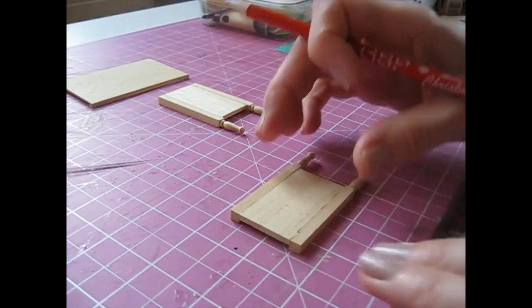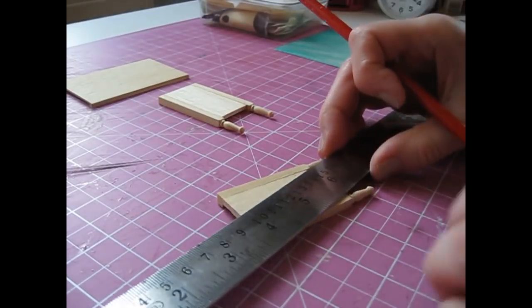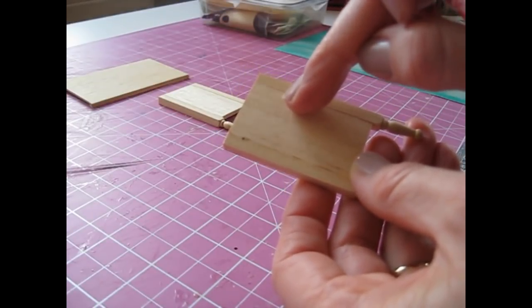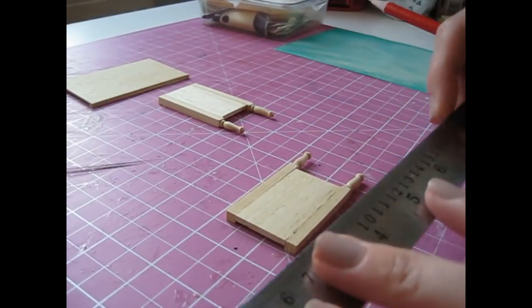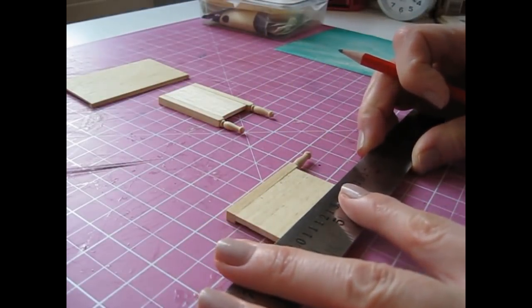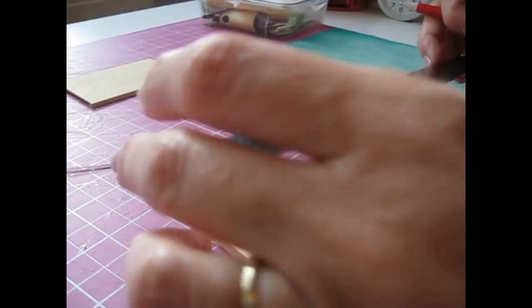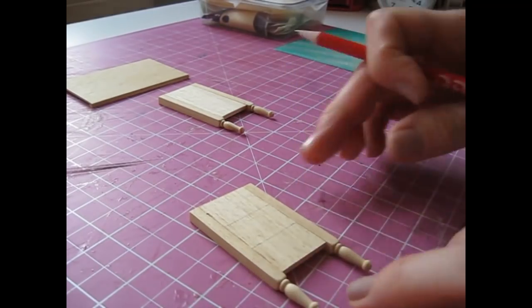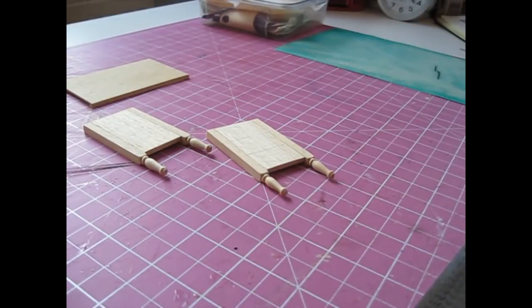Bring in your side pieces and do the same thing. When marking the side pieces, I just mark on the actual side and don't continue the line onto the leg, because the shelves will only sit on that inside edge and it makes it more difficult to erase pencil marks on the legs after construction. So again 18 millimetres and 34.5 millimetres — 45/64ths and 1 and 23/64ths of an inch — join those up sticking to the inside area. Do the same with the remaining side piece, and then construction can commence.